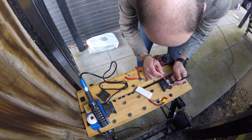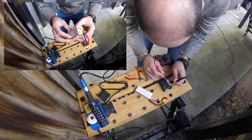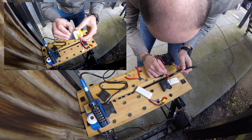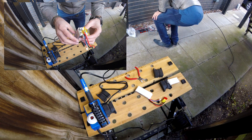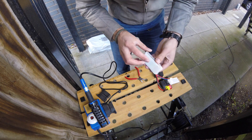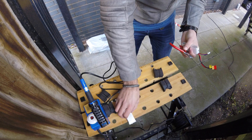If you have minus voltages that means you have to reverse the polarity — touch here and all like so. Remember, one is going to be positive and one is going to be negative. Use your multimeter to double check on this. You're going to have to pull them apart; they're generally stuck together so you may actually have to just cut them. Be very careful when you do that.